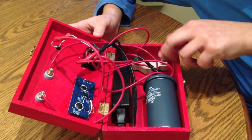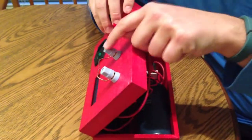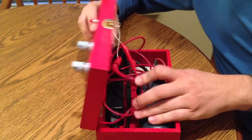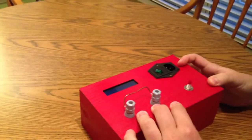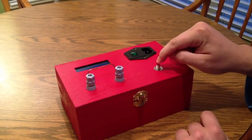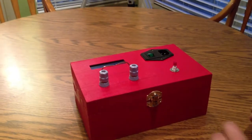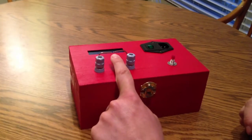The high side, or the secondary side, comes out of the top here and is connected up to the terminal on the top. This other side is connected to ground. So what we should see is when we plug this thing in and push this switch down, it should energize the coil. Then when we release the switch, that's going to effectively turn off the current to the primary side, and we should get that high voltage spike — we should see a spark jump across these terminals here.